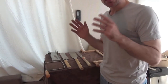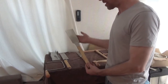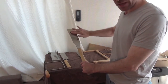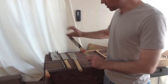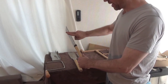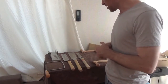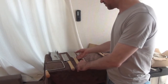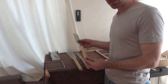For long straight cuts and all sorts of other things, I use primarily Japanese saws. The Ryoba is great — it's got two types of teeth for different types of grain. I also use a small flexible Japanese saw and one which has a rigid spine on the back. I use Japanese saws because I live in Japan and they're what you get at the hardware store, but also they're pull saws and they give a very, very nice cut. I also use one of these saws for cutting fret slots.